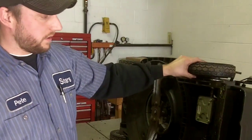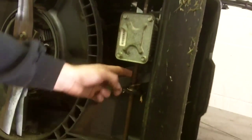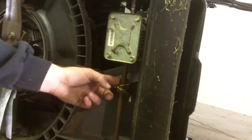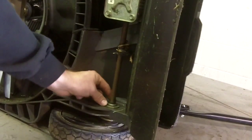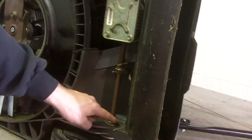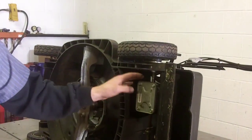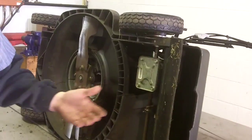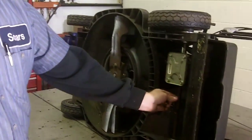One of the big places to look on any of your lawnmowers is near the transmission on the axle. As you can see on this lawnmower, there are some strings that are wrapped up around the axle. You want to make sure that you remove any strings because if they get wound up too tight and start to penetrate the bearings, it will damage and dry the bearing out. The same thing with the transmission — being that this is a hydrostatic transmission, the oil will drain out and the transmission will become damaged. So you simply want to pull the strings off of the axle.